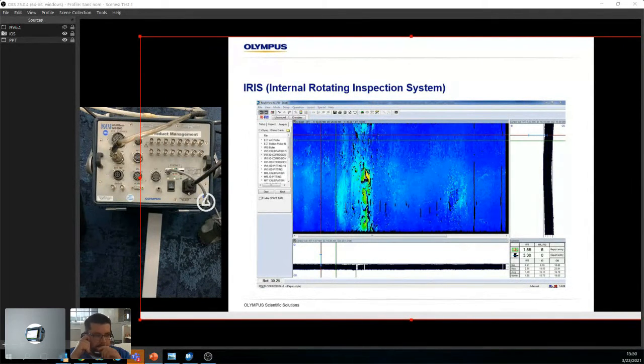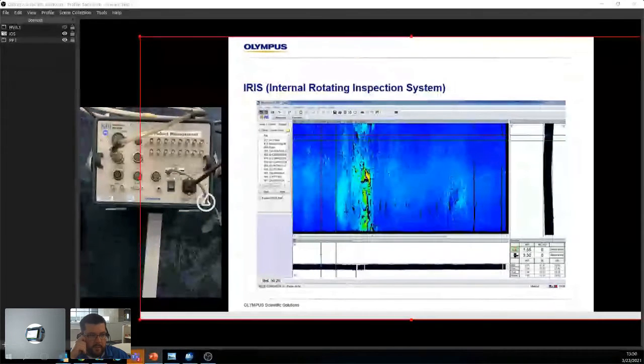When dealing with bends, usually where you get most of the corrosion problems will be right in the elbow. So you're going to detect that. You'll be able to go around there easily. For remote field, we have the TRG and the TRC probes. So those will go around the bend. Once again, you might get some dead spots, some dead zones, but usually you'll get it before the elbow and after the elbow. Sometimes right in the middle of the elbow, in that extra high angular area, you might not get it as well.